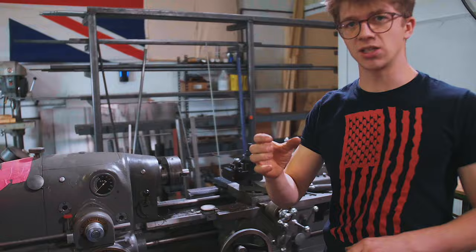What I'm going to be doing is cracking on with the punch that we need to make. We want to stamp in the imperial mark. To do that, we have a piece of 4340 steel chucked up in the lathe. I'm going to turn it down — it's going to be a mixture of lathe work and then carbide burr work to make a stamp, and we're also going to harden it. I'm going to turn down the outer diameter probably to about 7/8 of an inch, about 22 millimeters, before working on some of the inside features of the stamp.